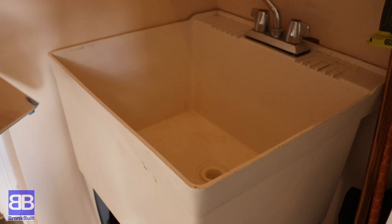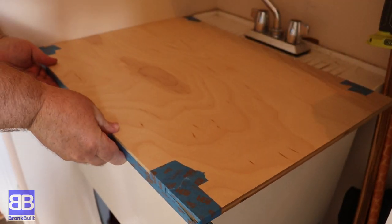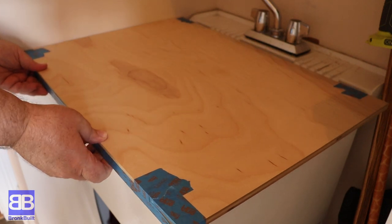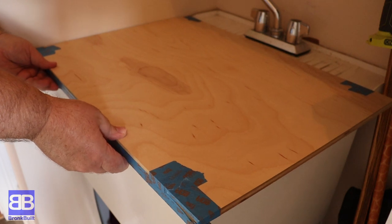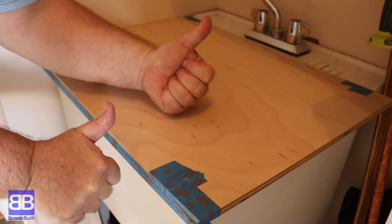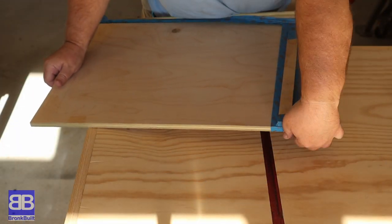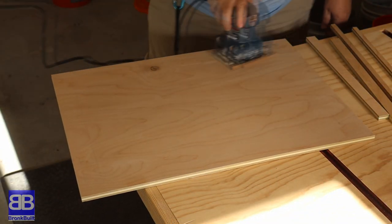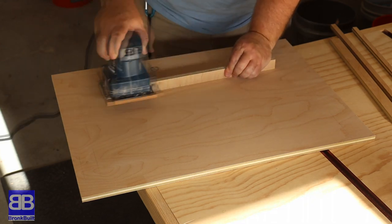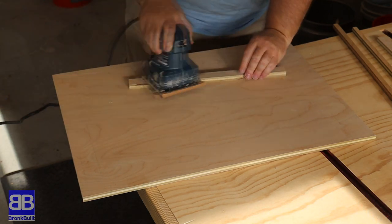To test the fit, I'm going to need to give away the answer to what this is. We have a pretty small laundry room and we don't have any place to fold clothes. While this will be a small shelf, it will give us some room to fold our clothes as we finish our laundry — we'll utilize the laundry sink for this. Testing the fit shows that all my measurements and calculations were A-OK. Now that the test fit showed my measurements were good, the glue tape comes off easy so I can give it a quick sand. I sand all sides of all pieces with 220 grit. Make sure you go really light with the sanding, as the veneer on the plywood is very thin and it's really easy to sand through.